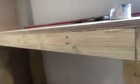You can see where I mentioned the glue earlier. This is now starting to foam out. It's not dry yet, but you can see the way that's foaming out. And then likewise, if we look under here, you can see the way it's expanding and filling all of the gaps that were possibly left between the supporting timber work and the ply top. So that's now completely safe.